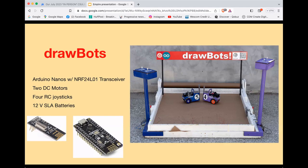Yeah. So, at first, also, rather than DC motors, I had continuous rotation servos in there, and that worked pretty good. But I would just burn them out eventually. The servos generally don't have enough cooling to do continuous rotation. Yeah, I would have to replace them. They would last quite a while, but I'd have to replace them every once in a while. The kids would find out what burned them up. Right. And, you know, they were like 12, 15 bucks a piece, cheap ones. I have a question about that.